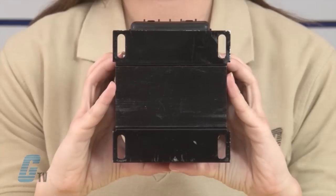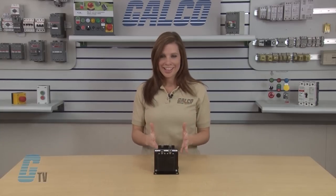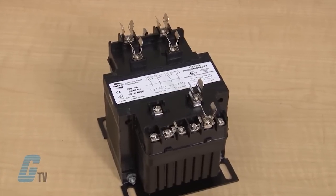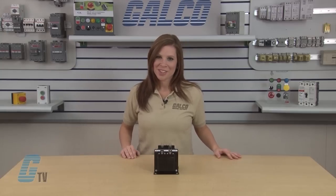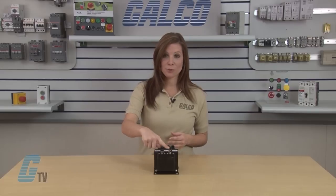The mounting feet are made of heavy steel and welded or bolted to the core, providing superior strength in a compact design. Terminal connection numbers molded into the terminal block correspond to the nameplate and wiring diagrams, which helps make connecting the HPS Imperator quick and simple. The terminal block design provides for easy hookup and installation of fuse clips.